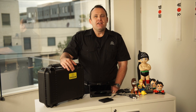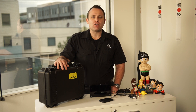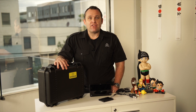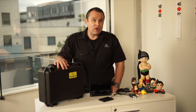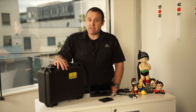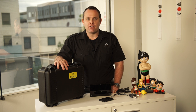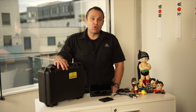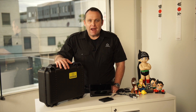Now some questions about camera support. We support almost every camera on the market with 4K output — if it's outputting anything up to 4K P30, we'll accept it over HDMI or SDI. The popular cameras we've seen are the A7S, the FS7 from Sony, and the AX100 camcorder. We also have the GH4 and the VariCam, from which you can record 4K. The GH4 especially has 10-bit output, and our HDMI and SDI are both 10-bit, so we record all those wonderful colors directly to ProRes in 10-bit. The Samsung NX1 has surprised us — it has a very nice sensor and a clean HDMI mode, and we've tested extensively with it. There are also other cameras where you may need a 4BNC-to-1BNC 12G converter to come into the Shogun, as we have 12G single connection over SDI. We also support 6G.